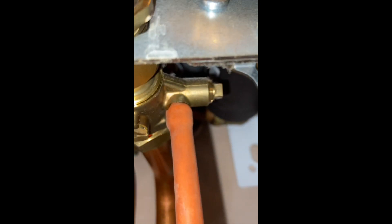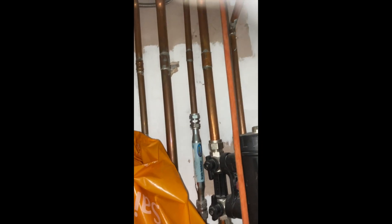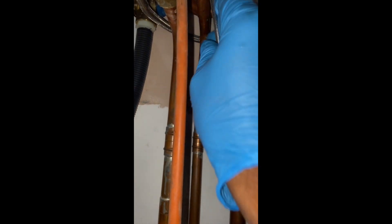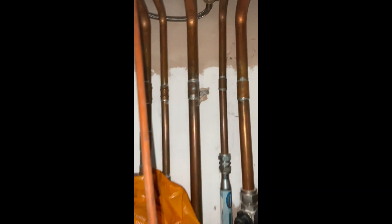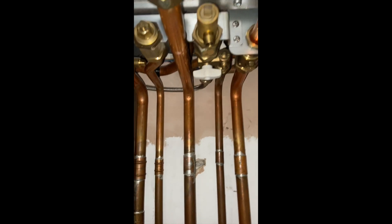And that's the return pipe, off position. Using a number seven spanner, open that and I'm using the hose to drain it — drain the heating circuit, the primary circuit. And then you will see the pressure goes to zero.